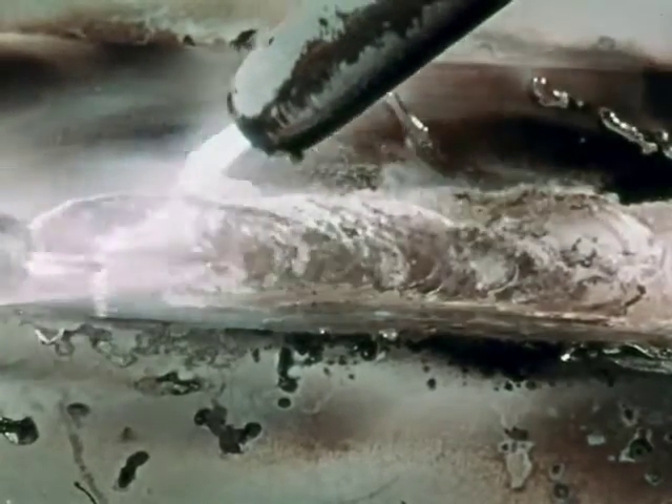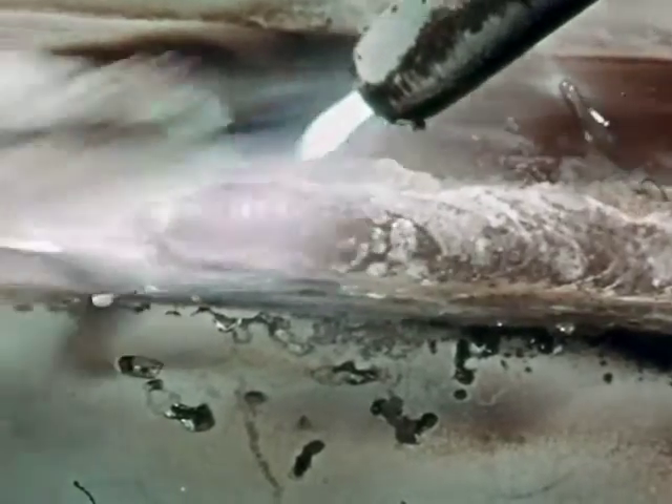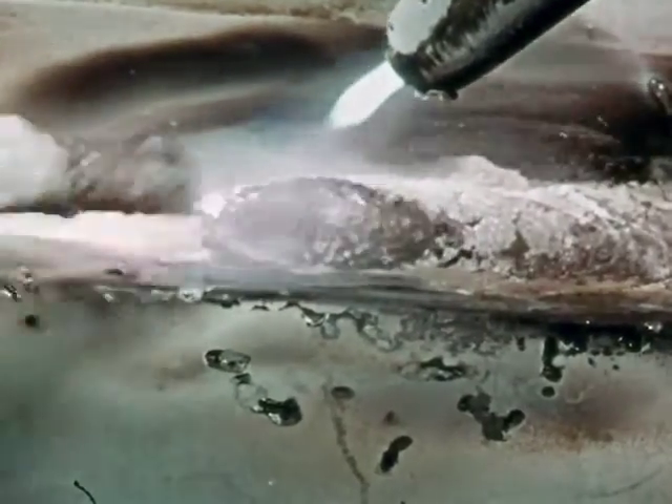Tin the upper half of the V as you move along. Also tin the top surfaces a little beyond the bevel on both sides. Practice to get a smooth, easy motion. As you make the last pass, keep the puddle smaller than before and build up the weld about one-eighth of an inch above the surface of the plate. Again, be sure to melt the surface of the previous pass. Continue the weld in the same way — first tinning and then building up two or three inches at a time — and be sure to melt the bronze deposited in the previous pass so it mixes well with the rod you add.